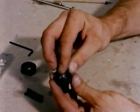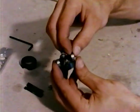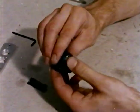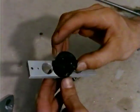The main rotor consists of a hub, which connects the main rotor shaft with the rotor head, the upper cardan unit with the control system, and the block mounting. All moving parts in the rotor head are assisted by ball bearings.